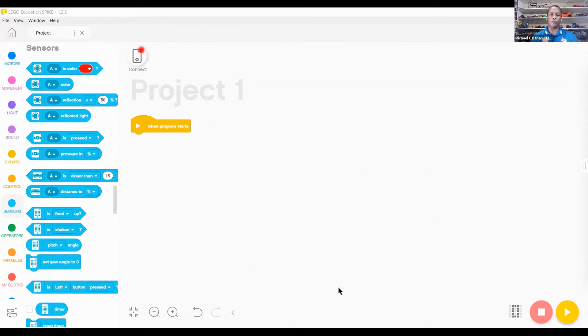In the programmable area's sensor section, you have the color sensor, force sensor (which can be coded in force or percentage), ultrasonic sensor (coded in distance or percentage), and your SPIKE Prime hub screen, which can be lit up with individual lights at different brightness levels from zero to nine — ten different settings. Each light can be dimmed independently at any time to create shapes, patterns, or rolling/flashing sequences.